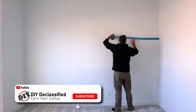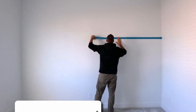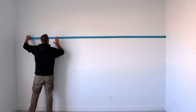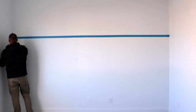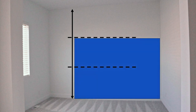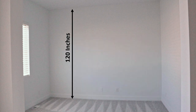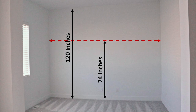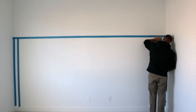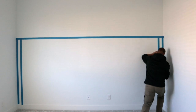The board and batten will go up about 60% of the wall height. We have 10-foot ceilings, so a strict one-third rule felt a bit off. The rule of thirds means to build your batten up one-third or two-thirds of wall height. There's also the golden ratio — just Google 'golden ratio calculator.' With my 10-foot walls, this put the top of the board at 74 inches, which in my opinion is perfect for this room.